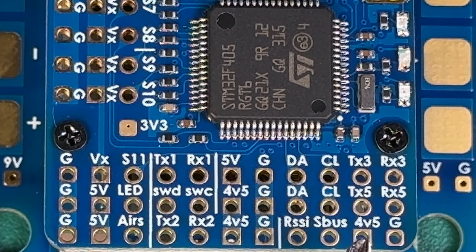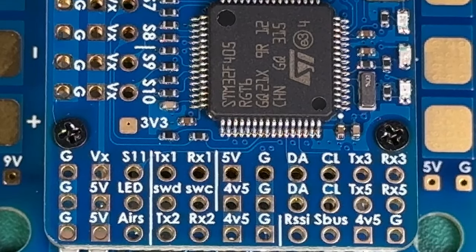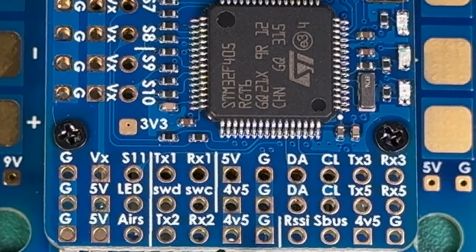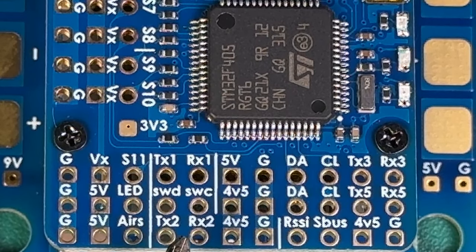The SBUS configuration will be serial 6, so UART 6 should be where SBUS is, as well as Crossfire. You can also put Crossfire on TX2 and RX2 on the bottom rail. Just don't forget to swap your wires — if you don't see something working in ArduPilot or iNav in your channel maps, switch those two wires and a lot of times the receiver will start working once it's bound up to your module and radio. You have 5 volt along these rails as well as more grounds.